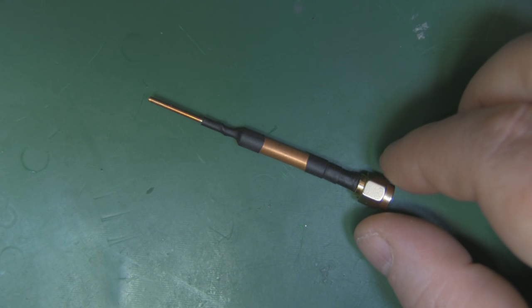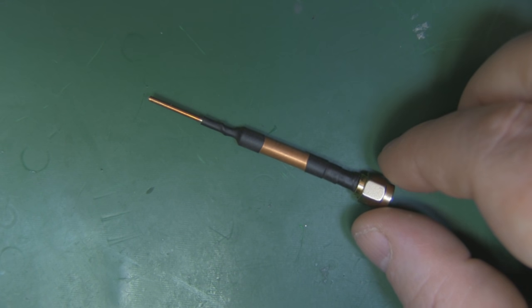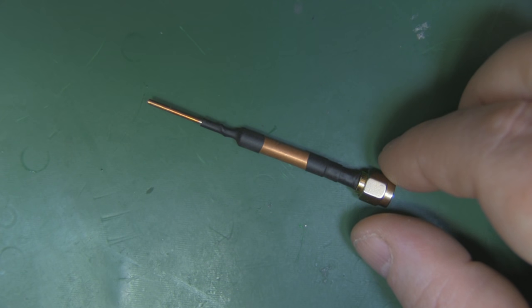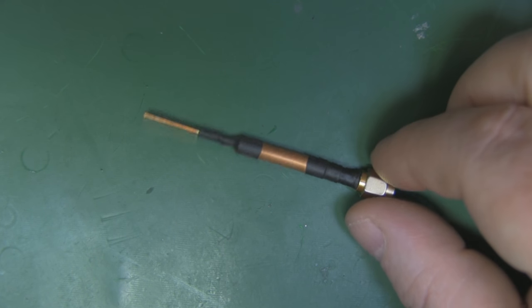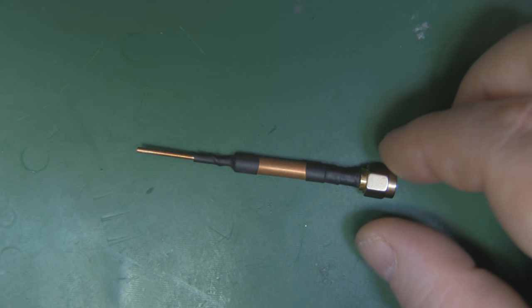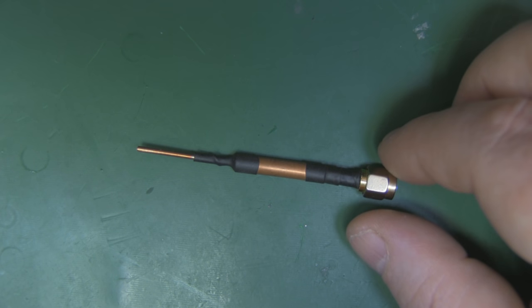This is my little reference dipole antenna that I used some time ago, and I use this as a yardstick when using my network analyzer. I have a scalar network analyzer, so calibrating it isn't the big job that a vector network analyzer requires, but I use this as a reference point. I know exactly how this performs so I can gauge other antennas that I'm testing against this.